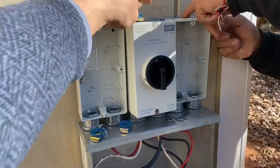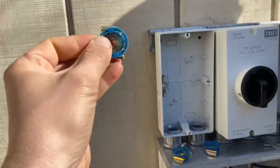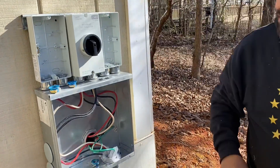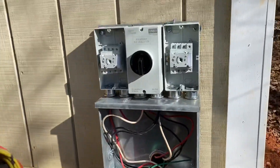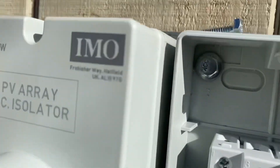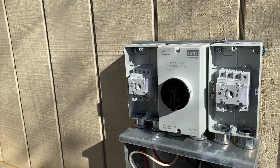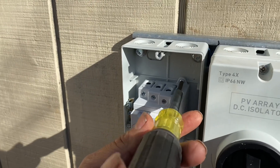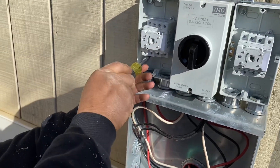I've got three IMOs on 12 inches of strut — fits just fine. Once we get the IMOs up, we're sticking these channel nuts in and attaching them to the rail. Antonio's got his IMOs all put together. When we put these IMOs up, we put a little gasket right here — it's a quarter-20 screw, just get a quarter-inch gasket or roofing screw. We are bolting the switch to the back of the housing. The screws are very easy to lose and they're a very weird screw.